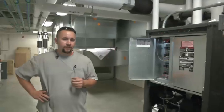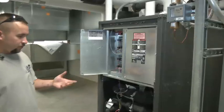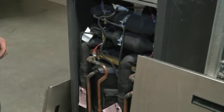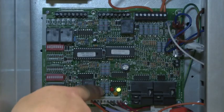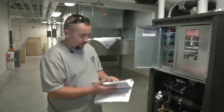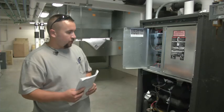I'm John Hyatt with Blau Mechanical here at Scott High School. I'm going to give a little owner training on geothermal heat pumps, hydronic pumps, and general overall HVAC equipment. We'll start on this water source heat pump, which is for the air handler here. Maintenance-wise these things are pretty friendly — there's not a whole lot to do. Annually you can check compressor amp draw and make sure it's within the 10% range. If you have any issues, the DXM boards have an LED setup that gives flashes indicating whatever fault they may be in, and the manual will point you in the right direction.